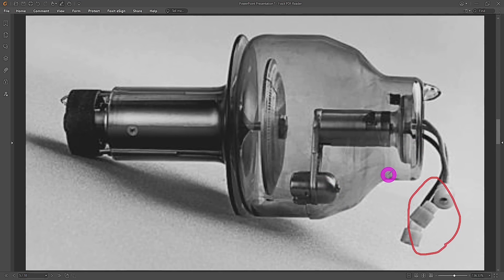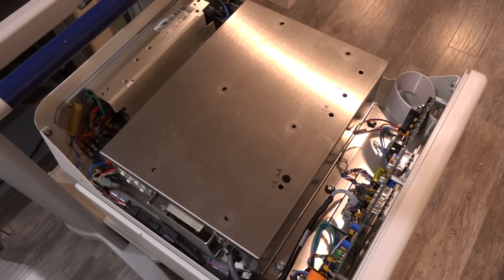Here's a nice example of an X-ray tube image found online — not the tube inside this machine, but it illustrates the point nicely. We can see the terminals for passing current and applying the high negative voltage on the cathode. There's a filament that creates electrons, they hit the anode plate, and X-ray comes out toward the target. This image shows some kind of focusing cup behind the filament.